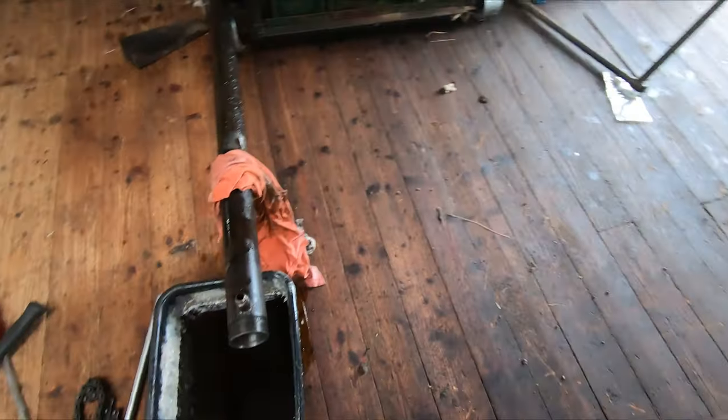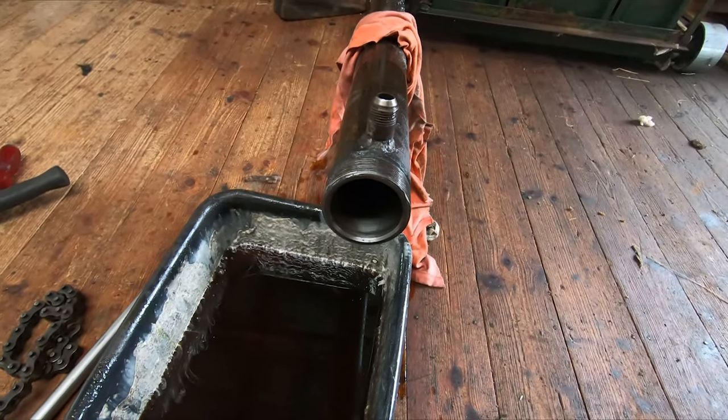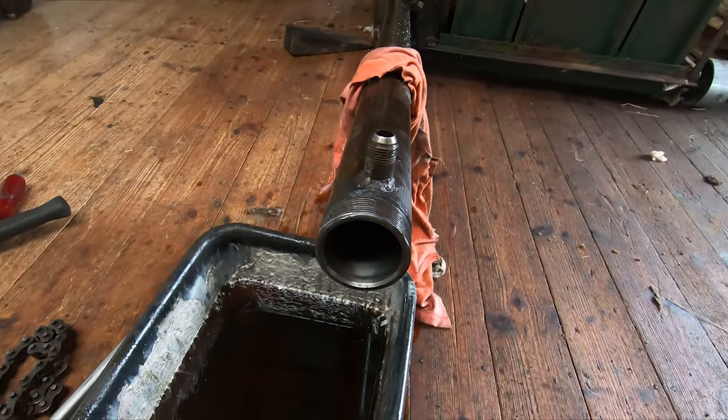And then, yeah, just had a look in the cylinder. Doesn't look particularly bad. The ram's got a little bit of marking on it. Not scored as such, but there's just a few dings and whatnot in it that, when we get it straightened, we'll get cleaned up a little bit, and then we'll just bang a hone down the cylinder, and that should tidy it up a bit, and it shouldn't be so rough, and that'll help it seal as well. So we'll just extend our hone so that it all cleans up good, and yeah, that should be good. So we'll tidy up here and we'll get ready to do this cattle work.